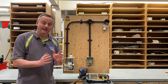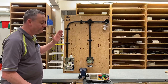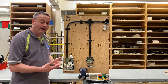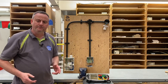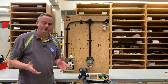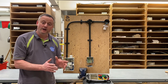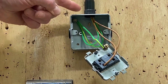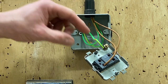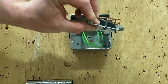In this video presentation we're going to look at the continuity of CPC, polarity, and insulation resistance tests of our level one PVC conduit exercise. We've got an exercise here which uses a one-way switch controlling a light fitting. This is the first time these learners have done plastic conduit, and we're reintroducing the process of carrying out those early dead tests. It's really important that we prove the CPC gets to the exposed conductive part of the box and the exposed conductive part of the actual frame that holds the switch.